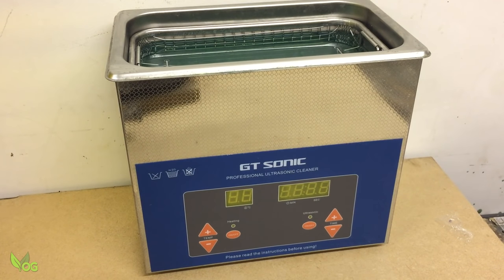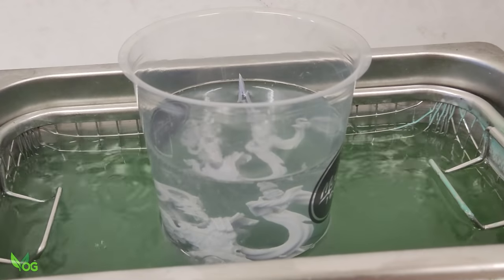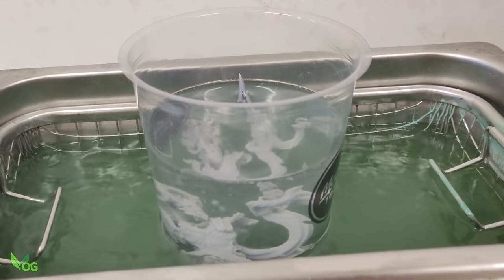However, one quick and very important safety note here. Ultrasonics like this tend to heat up the liquid. They take half an hour or so to do this, but heating up a flammable liquid like IPA is a potential fire hazard. So just a couple of minutes is ample and don't leave it unattended.